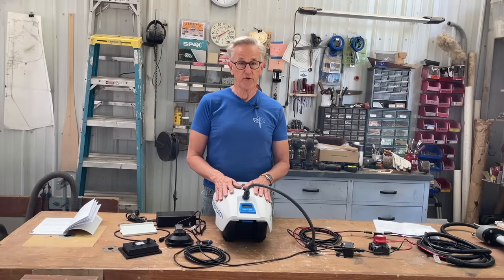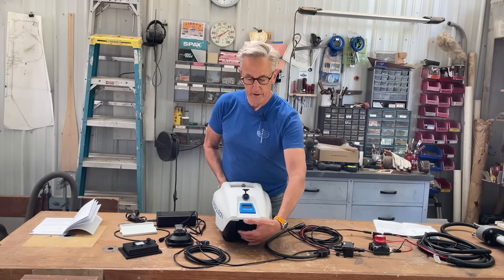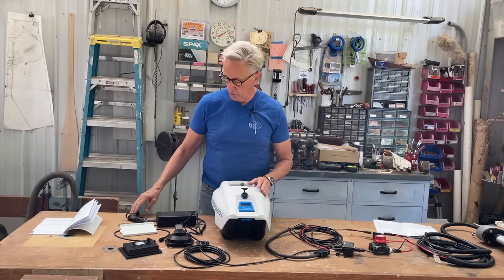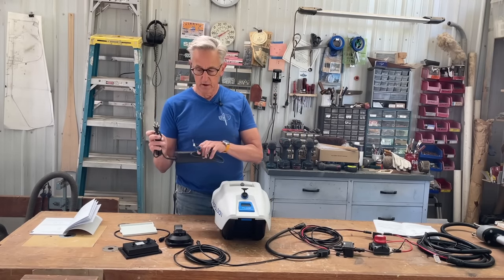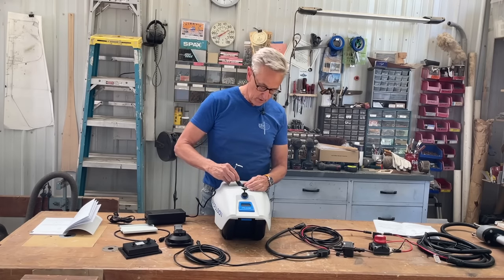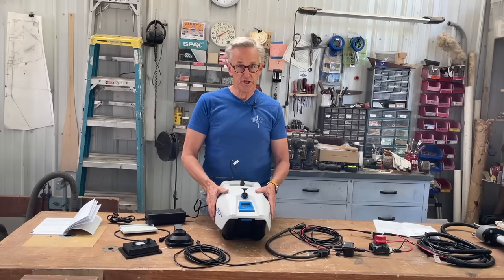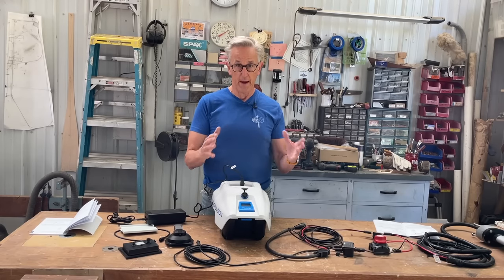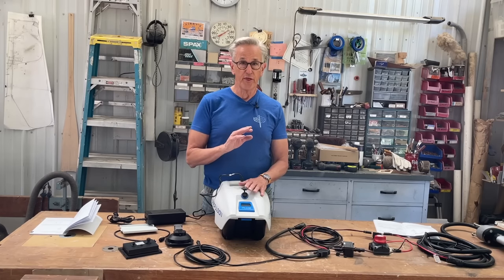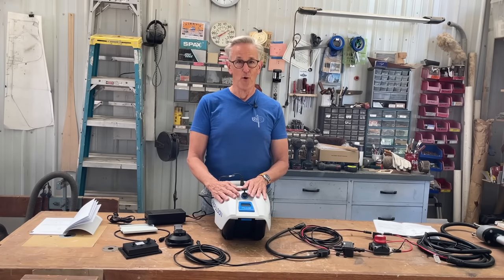Once the battery needs to be recharged, it's very easy to disconnect the control cable, and the battery simply will lift right up out of that case, so you can take it to a household current, where this charger, which changes 110 AC into DC, simply plugs in right here, like that. This will sit inside of the case where the actual outboard motor sits right now. So the first order of business is to take that case apart and start disassembling that old outboard.